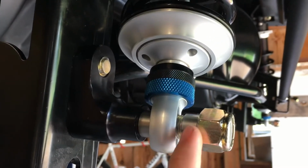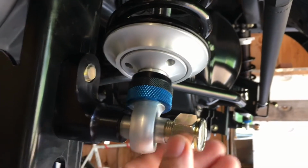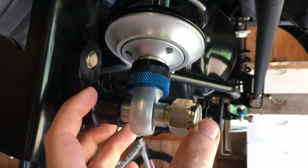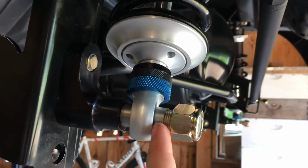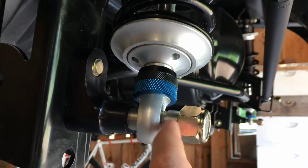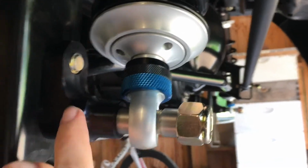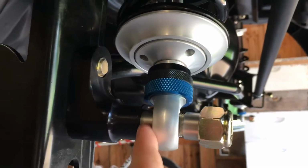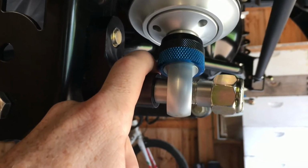These are little steel spacers to help keep enough room between the end link, so you can get articulation. The problem that I foresee is that you really have to crank down on this bolt to compress this whole stack to keep it stiff. That may be fine for this spacer between this grade 8 nut and the steel ball link on the inside. But here you have this going into this aluminum hanger bracket. If you really crank down on it, this steel spacer with the very thin sharp edge is going to bite into this aluminum, and whether it crushes in too much or not, I don't know.